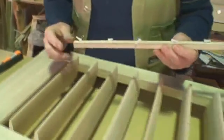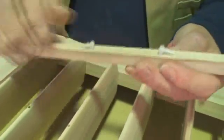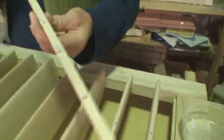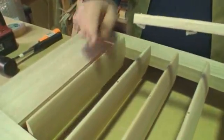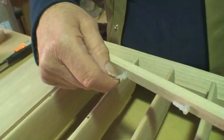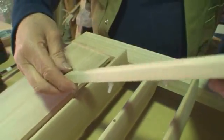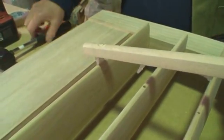So then the important part is to actually make them parallel to the control rod itself. They don't have to be exact because they will turn, but the closer they are the better it is. Having got them straight and good looking, the next process is to insert them in the holes. You'll notice that the first couple of mil of the pin doesn't have teeth on it. That enables us just to drop it into the hole and make a start. So just sit her in there gently and then tap her down